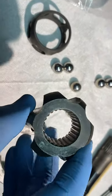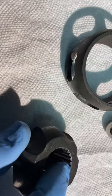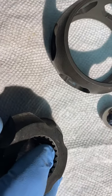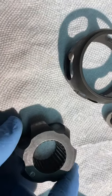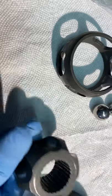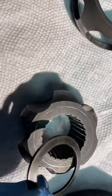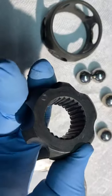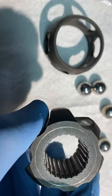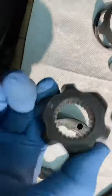This gadget — being the outer — if you didn't mark it, look at the beveled edge here. That means the beveled edge goes on the outside, which is where the circle clip goes. If you forget, you could look to see where this ring was rubbing. See the line where the ring was rubbing? Then you know that the step was down in this area, rubbing against there. If you didn't mark this, that'll help you determine where it goes on the shaft.